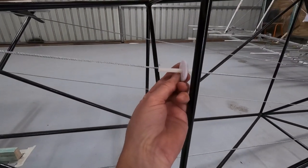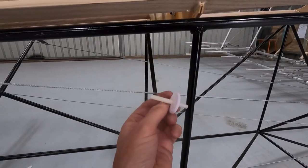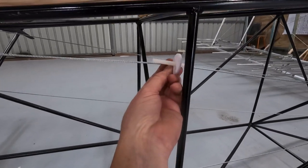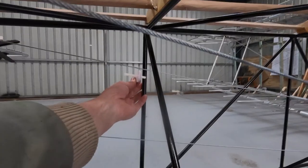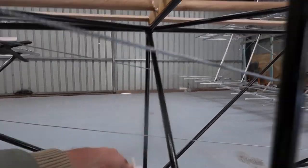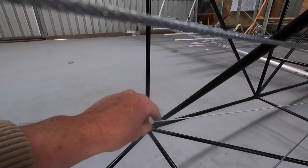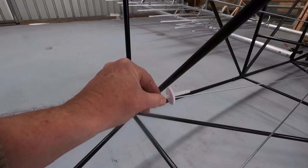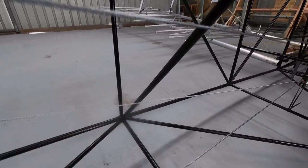Not sure about this one. It might just be a case of an Adel clamp and then a lock wire up to the top — just thinking out loud — that might work just to stop it dropping down. Not much inverted flight going on. One over here, one down there, just where they come close, like here. Don't want that rubbing, so I'll just put a fairlead in there.